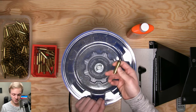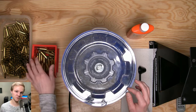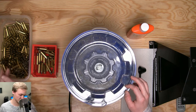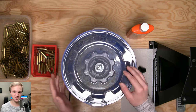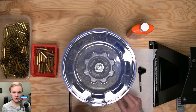The reason I do that is to get all of the carbon and most of the grime off the brass so you don't damage your dies. I only have 25 pieces for each, and with each tumbler it doesn't matter which one — you're going to want to do at least probably a hundred pieces of brass if not more.